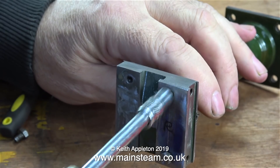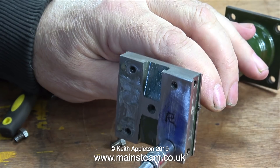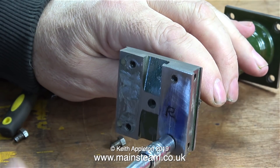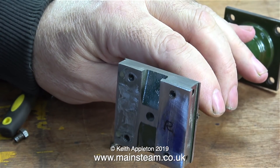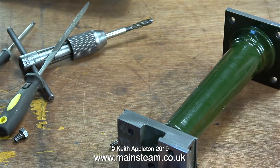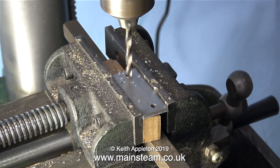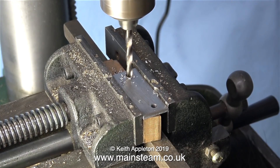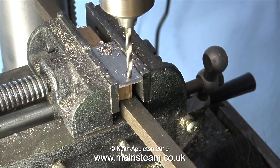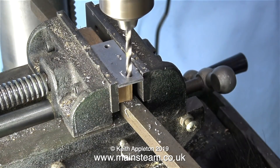As I finished the job, I didn't really like the mechanical principle of having the plates Loctited to the top of the column, because I got a very good and secure depth of thread down into the cast iron. And as the cast iron is plugged with steel, that should be more than strong enough to hold the bearing blocks for the beam. In this clip I'm drilling out the threaded holes in the plate — drilling them out to 3/16ths of an inch, which is a good clearance size for a 2BA bolt.